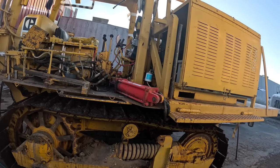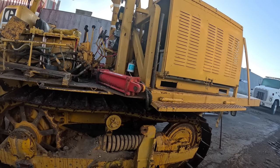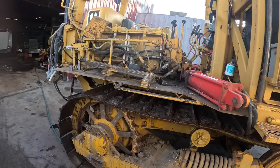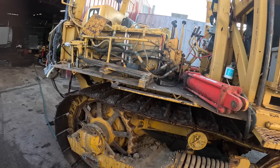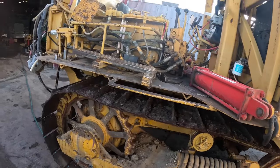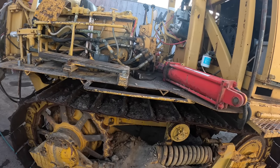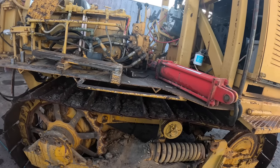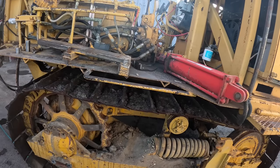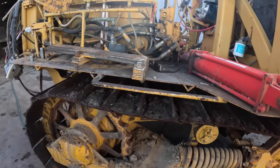The guys around here think they have to have their welder turned all the way up any time they air arc. I had a call the other day by a guy: Hey, can you come out here? Our welder won't go high enough to run this air arc. I said, what are you running it on? He goes, we got a Bobcat 250. I said, what are you trying to do? We're just cutting some welds off. I said, you don't need to run it at full amperage. What size rod are you running with your air arc? He goes, quarter inch. I said, well, you got enough amperage. What do you mean? I said, if you got a 250, you run around 210, 215, and that's plenty for what you're doing there.